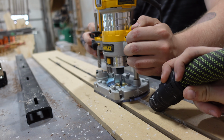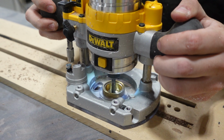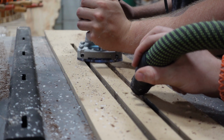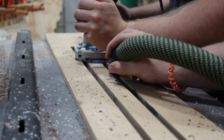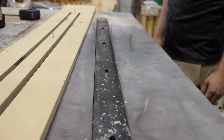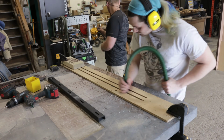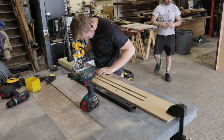Another important step when you're working with slabs of wood that are extra wide is to install C-channels. So that's what we're routing in here right now, is 2 little grooves so that the C-channel can slide in and be attached to the underside of the table. On river tables though, where you split the piece of wood and it's not as wide, C-channels usually aren't required.